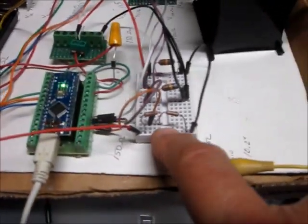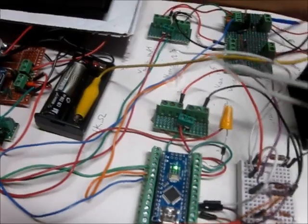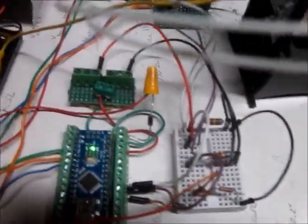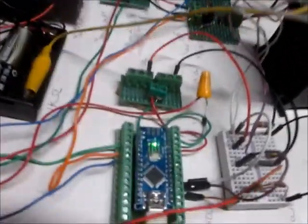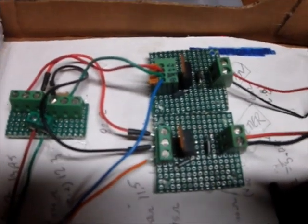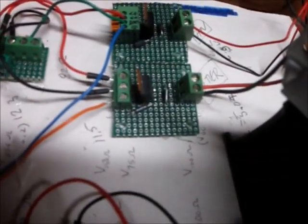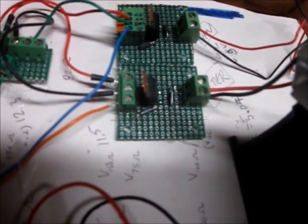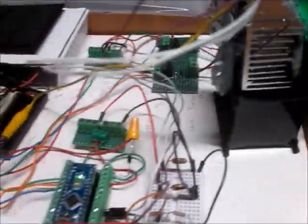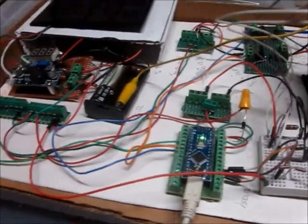Over here is the voltage feedback from the batteries through a voltage divider. And then we have dropping resistors for the thermistors for doing a voltage divider on those two. This is the Arduino control. It's got gating for the fan, MOSFET speed control, and for the peltier module voltage control. Okay, so nothing runs until we turn the battery on and it detects volts.